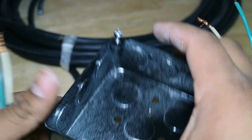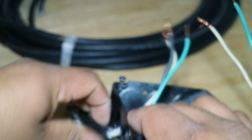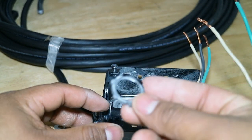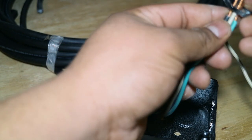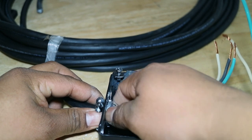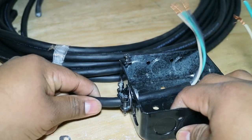Then get your box. This box comes with a knockout cover that you can knock off with a small hammer or screwdriver — I already took one off. Slide the wire right in there, then fit the clamp pieces into place. Slide that right in and tighten it up. Once you tighten the screws on the clamp, it keeps the wire from sliding in and out.